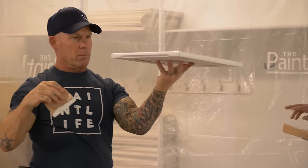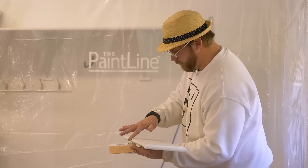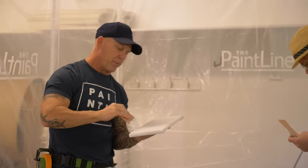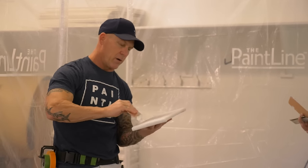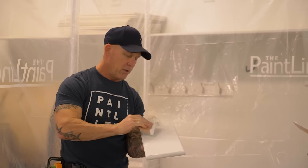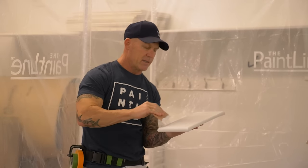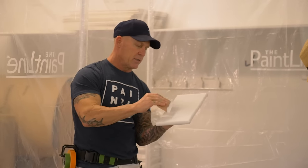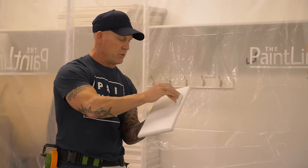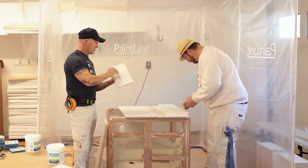And not bringing the fumes into a client's home, because now that everybody works at home, the more comfortable you can make it, I feel the better. If I was priming these myself, if I was doing the painting of them and not just the aqua coating part, I like using Renner 851, which is a 2K top coat, and Renner 643 is a 2K primer that will block tannins. So it's a 2K water-based primer. I really like using water-based products, and Renner's 2K 851 and 643 is an industrial PU that's absolutely amazing.